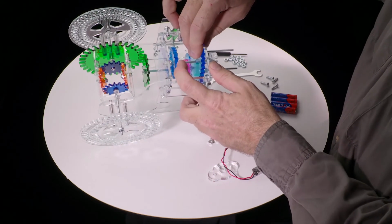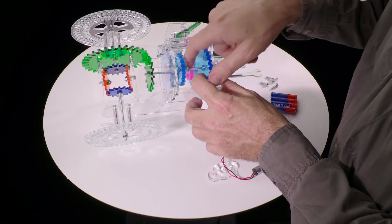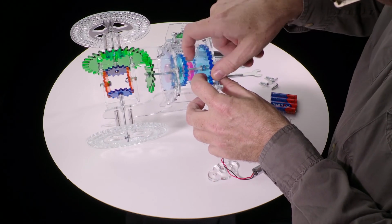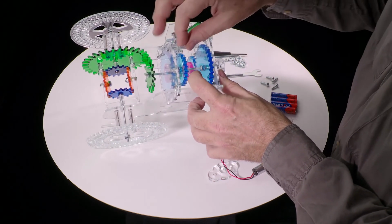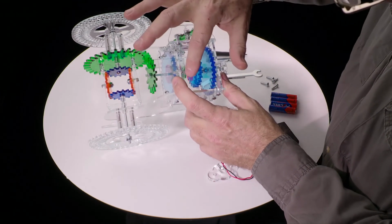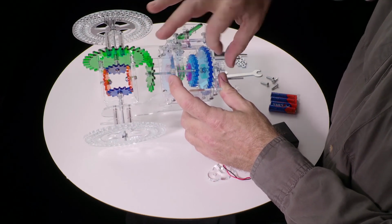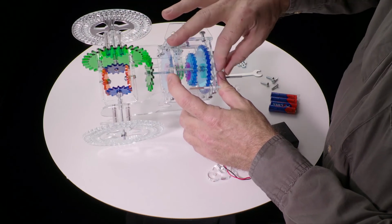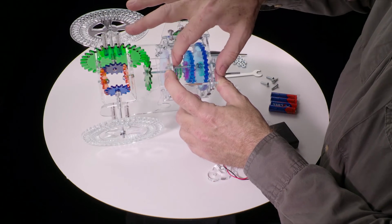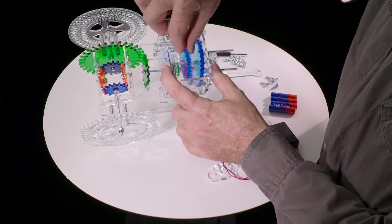Then move that gear in place and use your finger to clamp the gear, that will hold both the shaft and the nut. Keep it from spinning while we spin this nut up into place. So that's against there. And now we back this one up just in order to get this gear out of the way, and spin this nut in the other direction until it's tight up against this wall, and there's again no play here. Tight, and then back up by about a half a turn, a little less, maybe a quarter or 3/8 of a turn, till there's just a bit of wobble there.